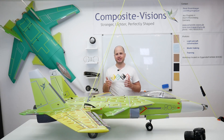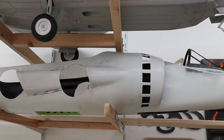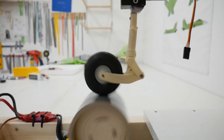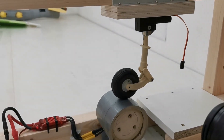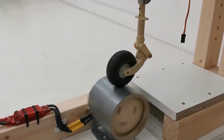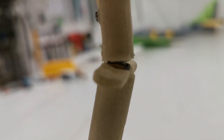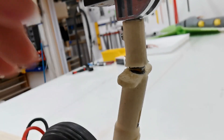Going on to figure out some information about different gear constructions. This is a stress test for the Harrier landing gear. This is the front landing gear from our big Harrier, printed from AF80 — an aramid-reinforced PLA. Let's see how it works. It broke right where the spring begins. There's not enough material inside, so we have to reinforce this.